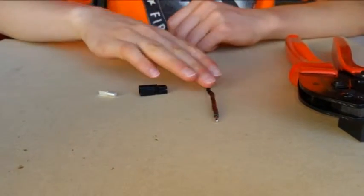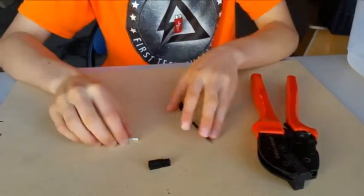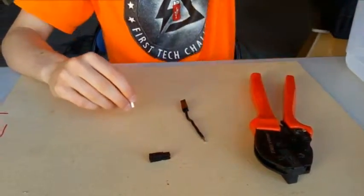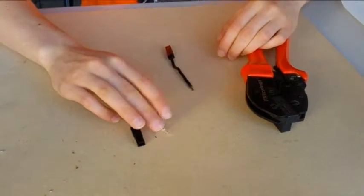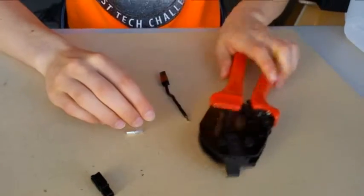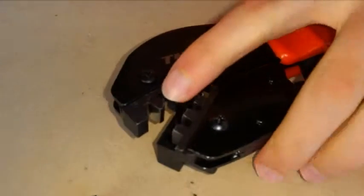After your wires cool down, we'll start our crimping process. Our wire is a 14 gauge wire, so we're going to be using the 30 amp Anderson Power Pole set. This set is for 14 gauge wire. Just make sure you have the right set before you do this — if you have too large or too small it might come off. In your Anderson Power Pole pack you'll have a metal part and a plastic part. The metal part is what we'll be crimping, and then we'll slide it through the plastic part. This tool here is also linked in the description — it's a Tri-Crimp crimper, a ratcheting tool that's really nice for crimping wires. On the Tri-Crimp you'll see 15, 30, and 45 — these are for the different amperages, so we're going to be using the 30 amp.